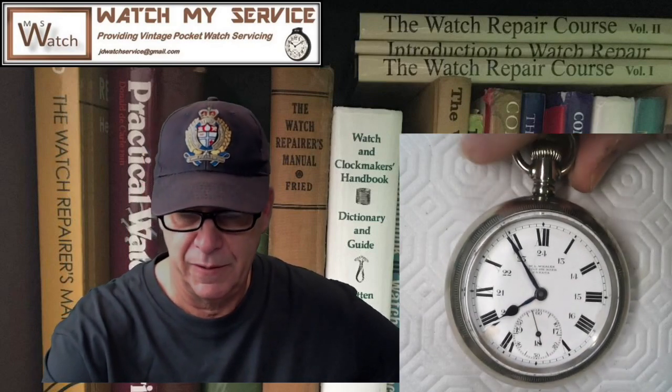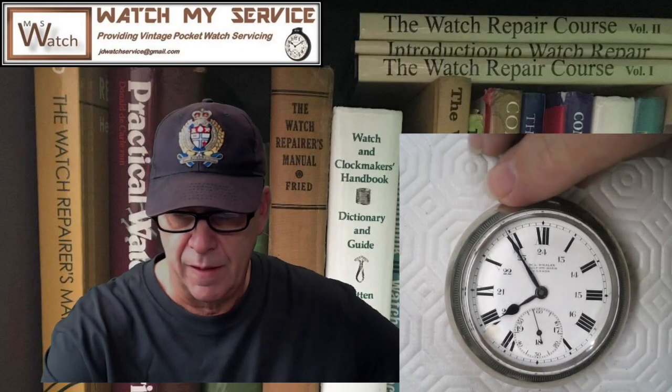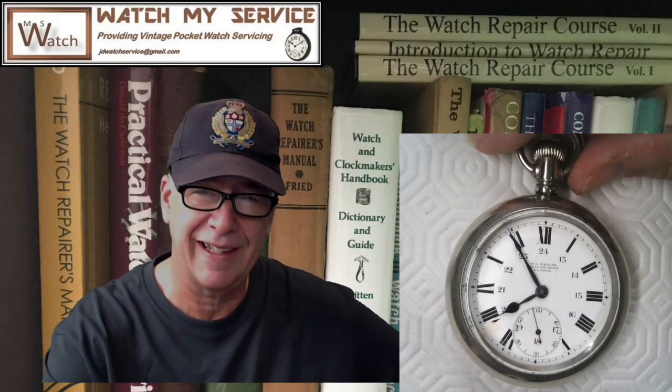I've also got Luke's watch sitting there that I need to figure out. I've been working on it for a long time — I was going to give it back and even pay to ship it back, but he said keep working on it. If I was being paid by the hour it'd be up to four thousand dollars. The only thing I can think to try is the impulse jewel — it looks a little rounded at the base, and if I can flip it out and it solves the problem, thank God for that.